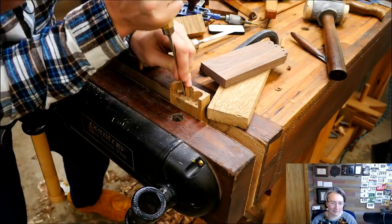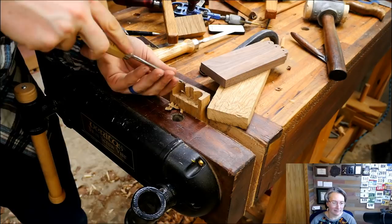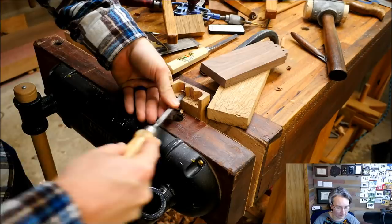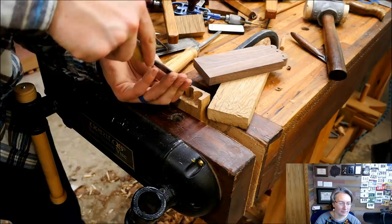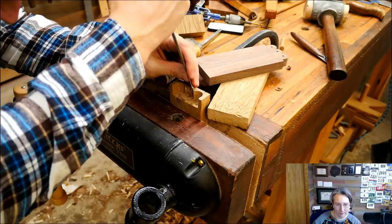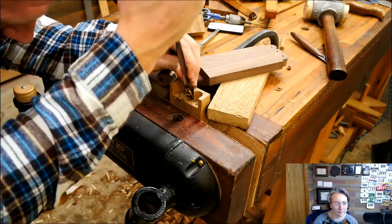As to their strength, they are a bit weaker than standard dovetails, but not by a whole lot. Really, it's a fairly minor amount of difference. But would I use these in a furniture build? Probably not, because they take 2 to 3 times as long to cut by hand as regular dovetails. So I think I prefer regular dovetails, unless this fit the style of the piece of furniture and would look really cool, in which case I might do it for that.